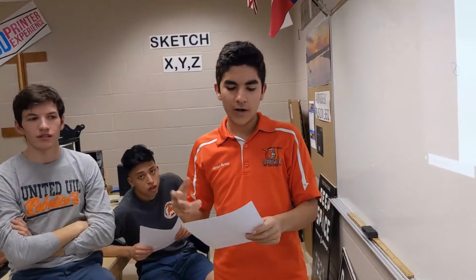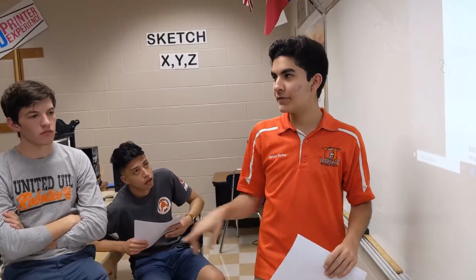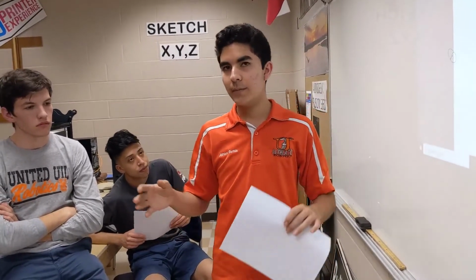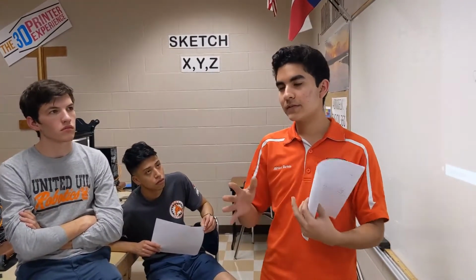So for the third strategy, we went with a low robot that would go under the trench to have faster cycle times, and you can utilize that safe zone of the trench to take less defense. We also went with the two-wheel shooter because it will be more accurate. With the one-wheel shooter, it'll cause more friction and spin and have more tangential velocity.